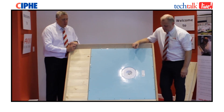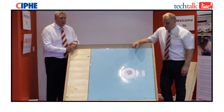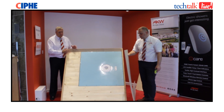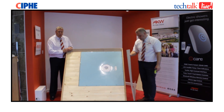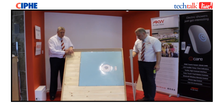Now the waste has been fitted, it's time to abrade the tray — sand it down to give you a better key for any tile adhesives or tanking kits that you're going to apply. Now the tray's fully supported and the waste is inserted, it's time to start preparing for your waterproofing and tanking kits. First thing you need to do is level out the floor: with the tray being 22mm high and the floorboards being 18mm, you need to level it out by adding a 4mm ply right across the bathroom area.